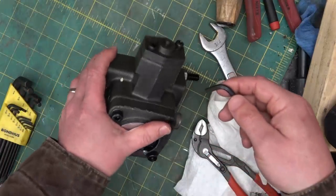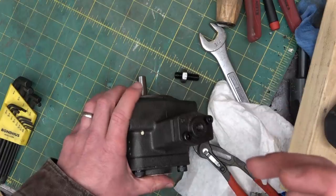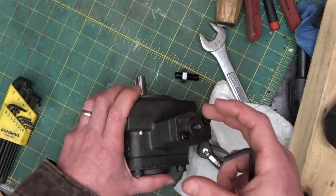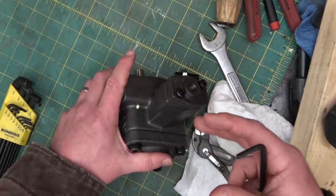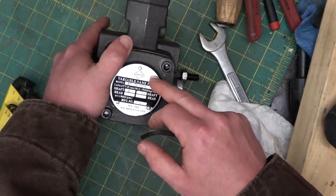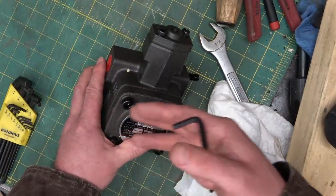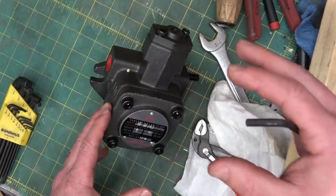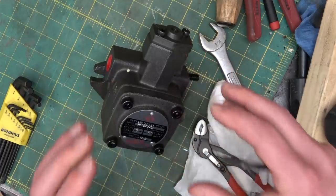This ain't my first kick at the cat on the hydraulic side. We've had a look at the ubiquitous and cheap gear pump — dumb, dumb control — and we've also had a look at a very expensive, very dear piston pump with pressure compensating and torque limiting and all sorts of valving. In betwixt the two of those is this variable displacement vane pump. When you first get into hydraulics, everyone makes the same mistake that pumps create pressure. Pumps do not create pressure. It is a restriction to flow that creates pressure. Pumps create flow.